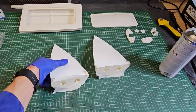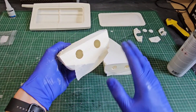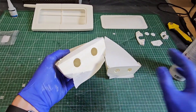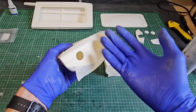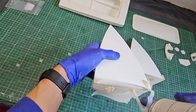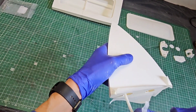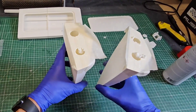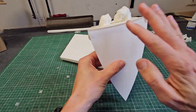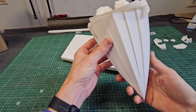I'm going to fill up the bow sections with PU expanding foam. I already taped the front section so that I don't make a mess of it, and I'm going to fill them about halfway — the expansion will be about twice, so finally they should be fully filled. The bow section is now drying with the PU foam, so I have to let that dry first before I attach it. That will be for the next video.